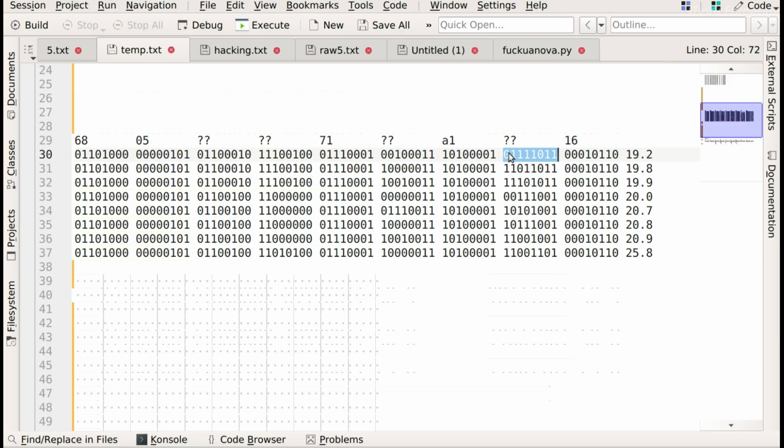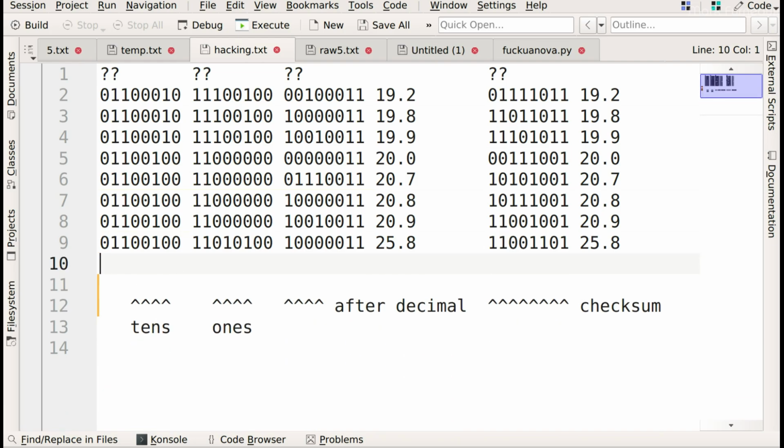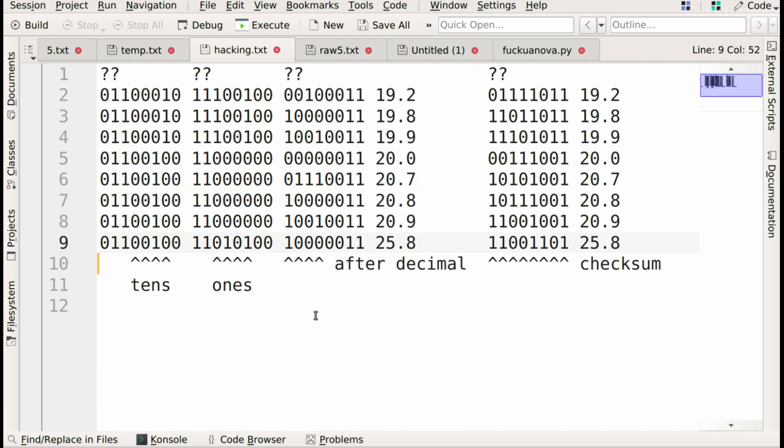So now at this point I was golden. I had ASCII coming out of it. I had the checksum calculated. I've got what looks like the header, footer and command all done. So of course, as you would do, you write a Python script that does this for you, and you feed it the entire stream of data.